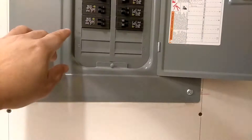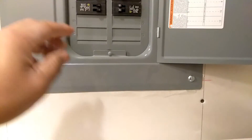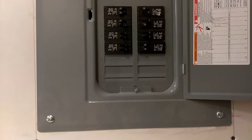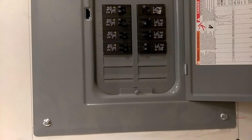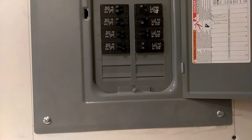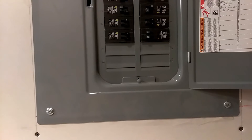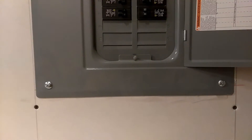This is my little sub box right here with all my necessities — I had my refrigerator, master bedroom, master bathroom, hallway lights, water softener, and pellet burner all tied into this system. All my lights in the whole house are LED. The hallway lights are about 10 watts each, five of them, so that's 50 watts. The master bedroom light fixture has four bulbs at 4.5 watts each — less than 20 watts total.